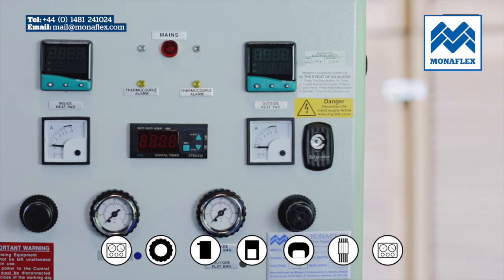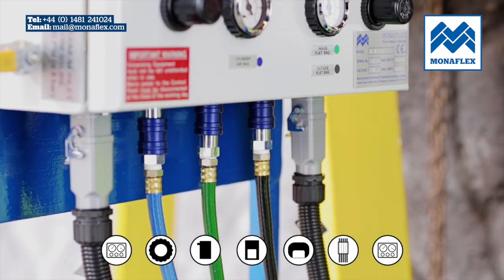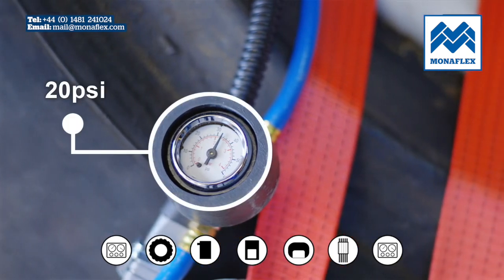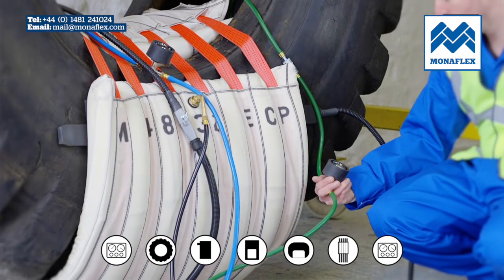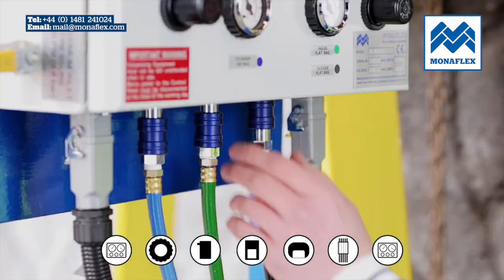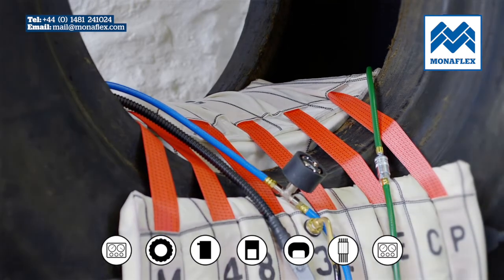When in the correct position, lock the knobs off by pushing down to click. Commence inflation of the cylinder airbag by pulling the panel slide valve down connected to the blue air line. When the pressure gauge on the blue air line shows approximately 20 psi, commence inflation of the inside flat airbag by pulling the slide valve down on the green air line. Let both continue inflating until almost full pressure at around 25 psi, at which point open up the slide valve on the external curing pack air line and all three airbags will reach the desired operating pressure.